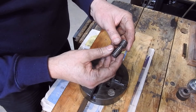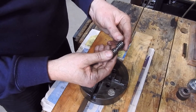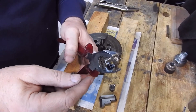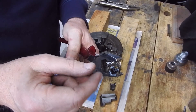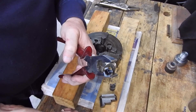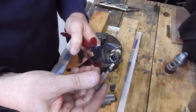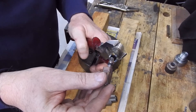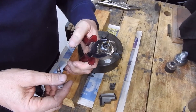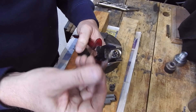Here's the screw. If you recall, there were cracks on the four corners. I've ground those out and tried putting a blob of weld metal there — how well it'll work, I don't know, because it is hardened and it may crack. One handy tip: if you've got an inside corner you don't want to distort, I used a bit of copper pipe I had sitting around, flattened it out and made it into a little angle piece that went inside there, so when I was building that area up I didn't have stuff blobbing through.